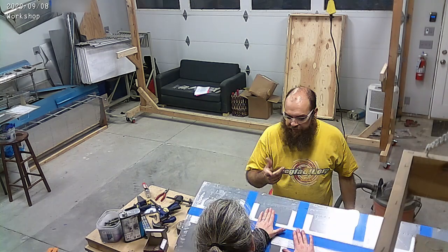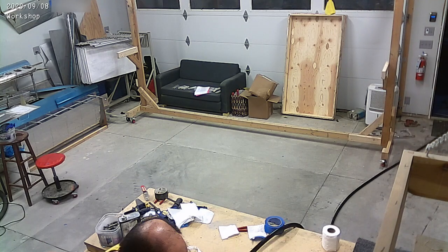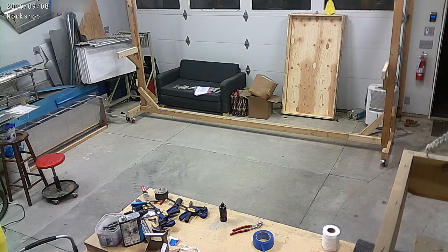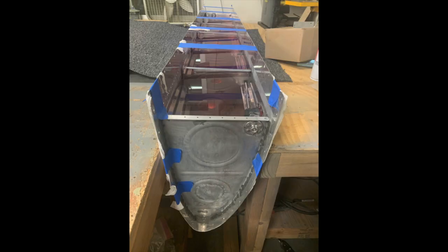That tank — we're putting toilet paper all over the rivet lines so that any leaks will show up. And then I'm filling them up with water with a hose from the outside, 30 gallons in each tank. We're doing one at a time. That's red food coloring, and we're putting 30 gallons of water with red food coloring in each one.